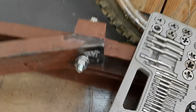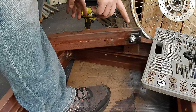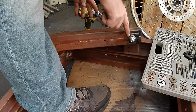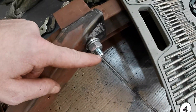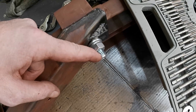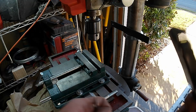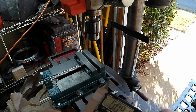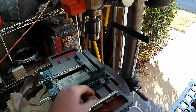We've got the new longer bolts in there. I also went ahead and welded and capped this off - made it flat. Both sides are done. Now that it's tight on both sides, I'm going to put a mark so that we can put this on the drill press and put a hole through it so we can put a cotter pin in it. It is the 3rd thread in. I'll take them back off and go to the drill press. The cotter pins I got are 0.09 inches, so I'm going to use this 0.109 drill bit - it should give me plenty of play to easily get this in and out.